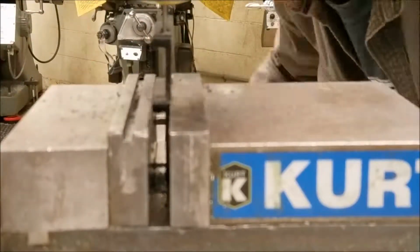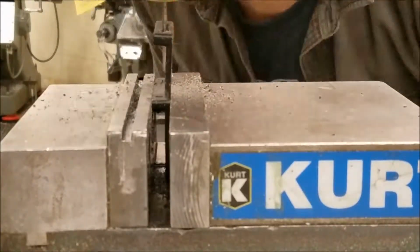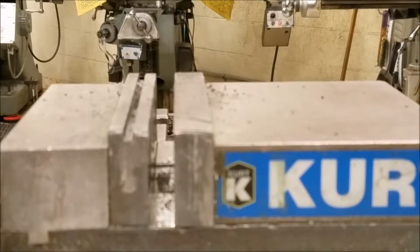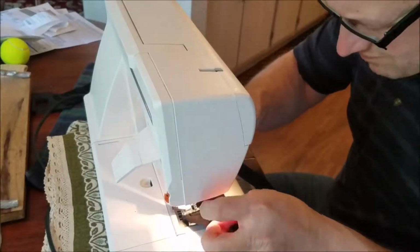I also took a different approach to making the parts for my belt and machined the hole and slot in the 3D printed parts I already had. This proved to be difficult because the printed parts are so flexible that they would bend away from the end mills. But in the end it worked.